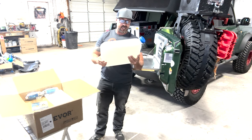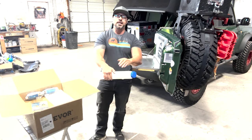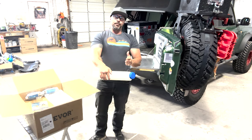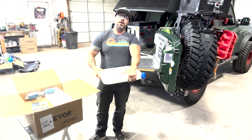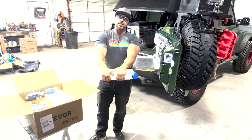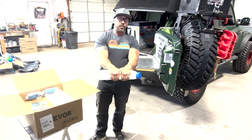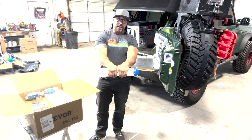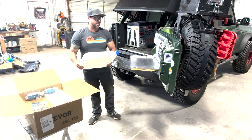And the reason being is because I keep it highly vented. And so that's why I run it so long. Not because it doesn't produce enough heat, but because I like to run it at a higher temperature so it's more efficient, which means you have complete burn and less soot buildup. But I end up having to keep my windows and stuff open more, which is okay with me because I end up sleeping with just a regular blanket and a sheet like you would at home in normal temperatures. So take it how you will. That's my thought on how you should do it.